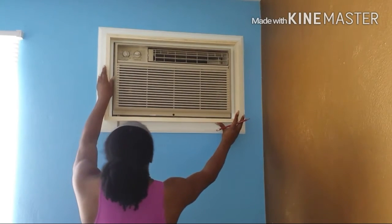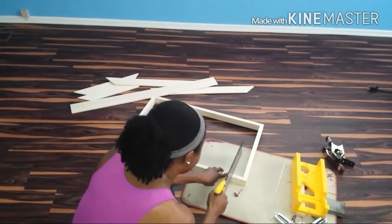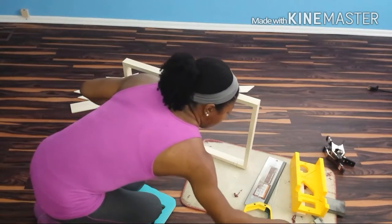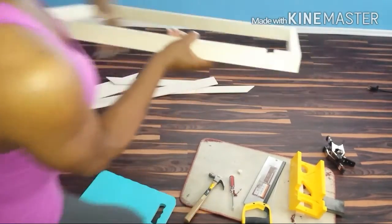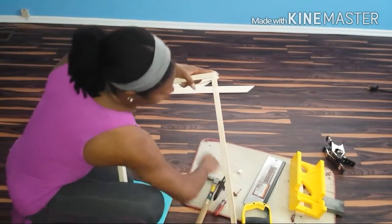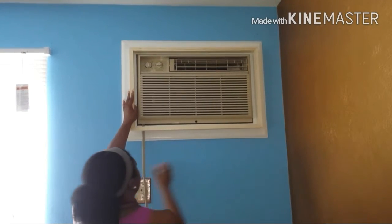Make sure you pull the cord through the frame. If you don't have a wireless unit, you're going to put the cord back down underneath the frame and mark around that cord, because we've got to make sure there's room for it to clear the frame. Then very gently use the saw to cut about a half inch on each of those markings. Since I don't have a small chisel, I'm using a flathead screwdriver and a hammer — giving it a gentle tap — and like butter, the little piece just pops out, giving a nice area where the cord can come through. Use a box cutter to carve away any excess wood splinters, and use a sanding block to sand down that area. Then double-check to make sure the cord will clear; if not, this is the time to make adjustments.